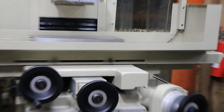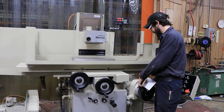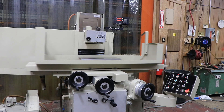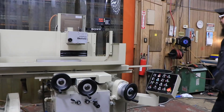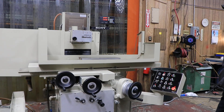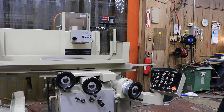I'll turn that off right now. I'm going to go ahead and bring this wheel a little bit closer down to zero so we can see it run through its spark out. Right now I have it set for two passes. Once it hits zero — it just hit its zero mark — so it's going to go back and forth, just back once and forward once as it sparks out, and you'll see it park itself.